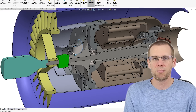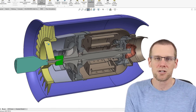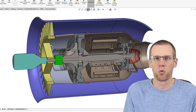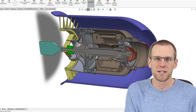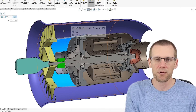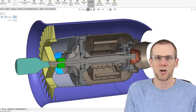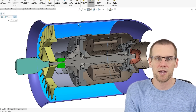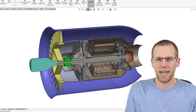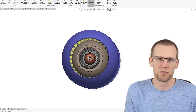Once we have that transmission, we can knock down the RPMs of the output shaft coming from our compressor. We want that because our fan is going to take a lot more power to rotate, meaning we can't rotate that fan as fast — this way we drop the RPMs, which works perfectly. Once the shaft is extended, we place our fan right onto that shaft. We need a couple of new shroud pieces that allow the fan to operate so air comes inside the engine, still gets directed to our compressor, and the air traveling around the outside core from our fan is directed by this shroud, which serves as our overall outer turbine case. Now that all those components are in place, this is essentially what would be required to get this type of system to work.